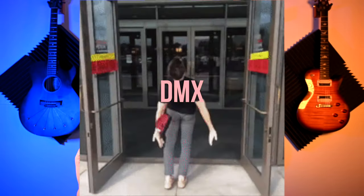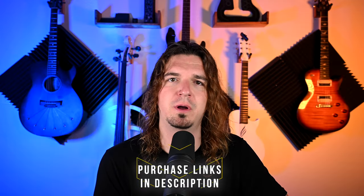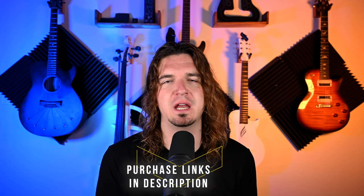In order to do this, you need some sort of DMX lighting controller that accepts MIDI commands. It needs to have MIDI in and DMX out. There are many controllers out there — some by Chauvet, American DJ, Elation, and others. The one I settled on is the ADJ DMX Operator. It's a really nice controller for not a lot of money. I'll post purchase links down below. But basically any controller that accepts MIDI and outputs DMX will work with this method.